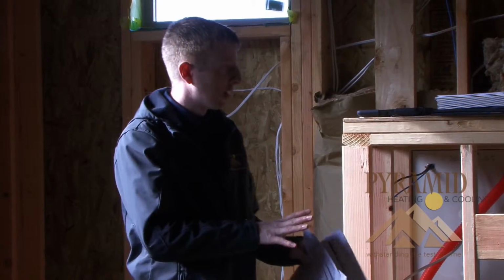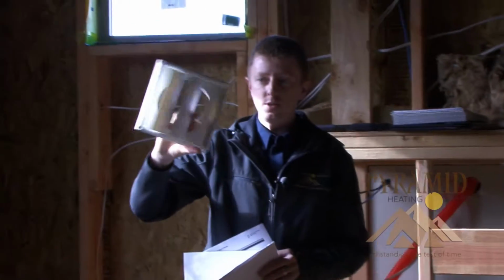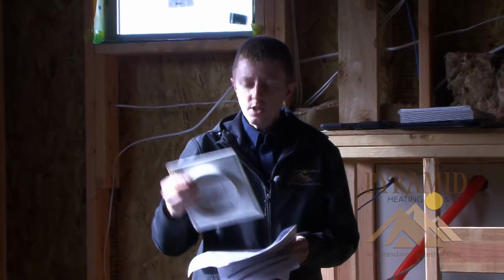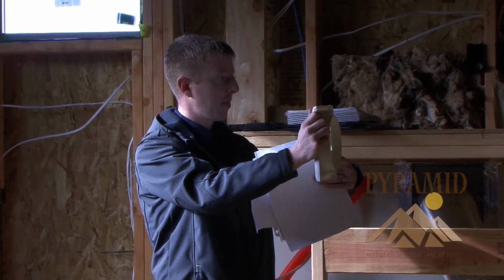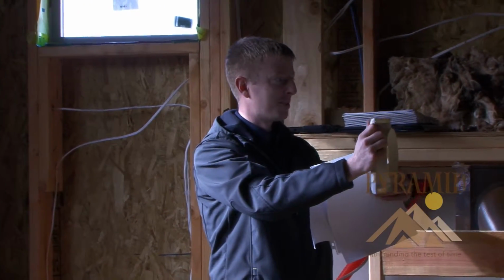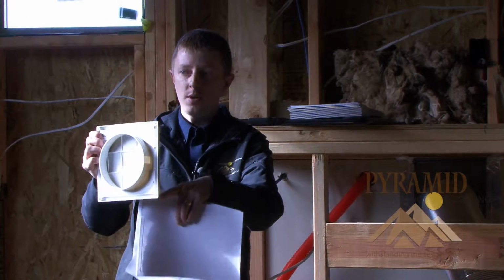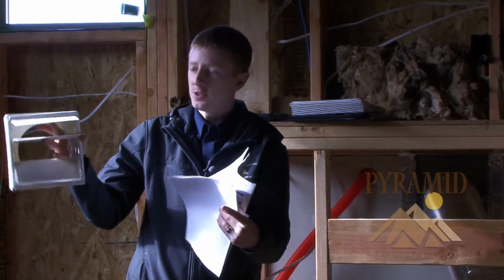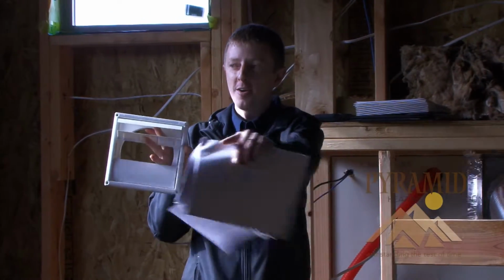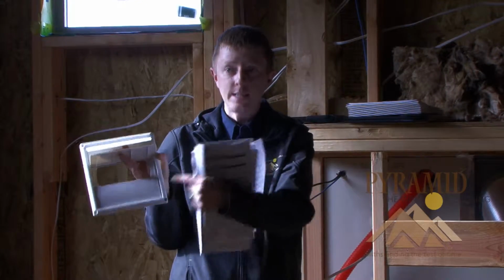The other thing, just on outside penetrations, this is the standard exhaust vent you see on houses. You see that, and if you want to get closer, it's fine. There's little weep holes on the back. I don't know why. Those let water in. You seal, as a builder, around here. That does not seal the holes behind. This opens and blows moist air out directly next to these holes. This is what is typically seen.